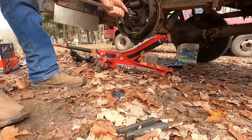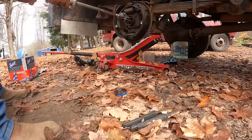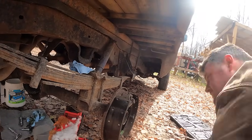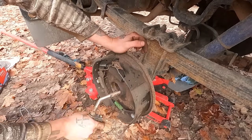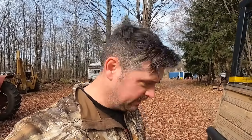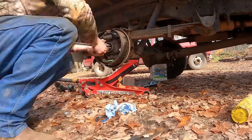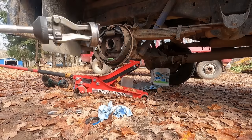The bearing race — what's left of that destroyed bearing — is kind of tough to get out of there. We've set up our three-jaw puller to see if that does it. Well, I've been trying to force it for a good 15 minutes, so it's about time to use fire. She ain't moving, so we're going to break out the extra spicy fire and try that. All right, we just about got it.